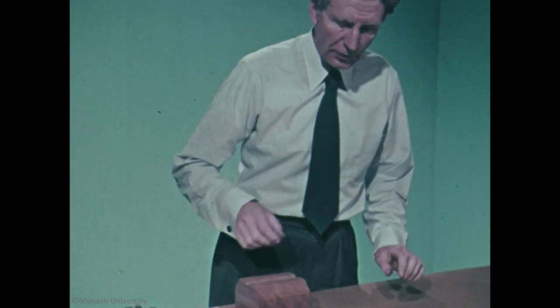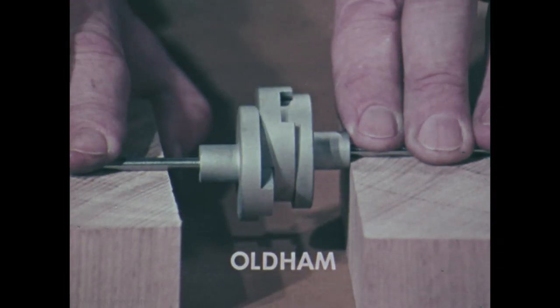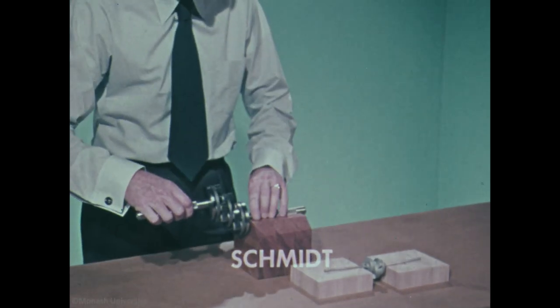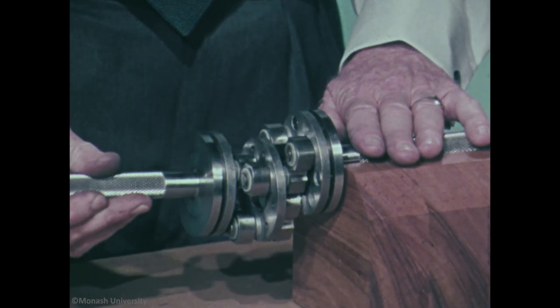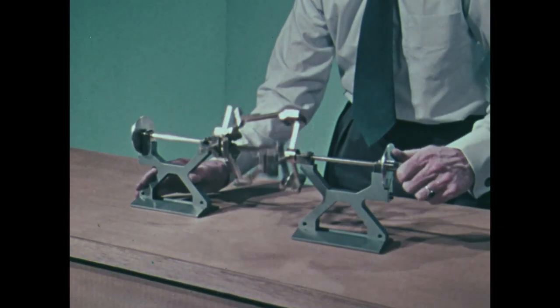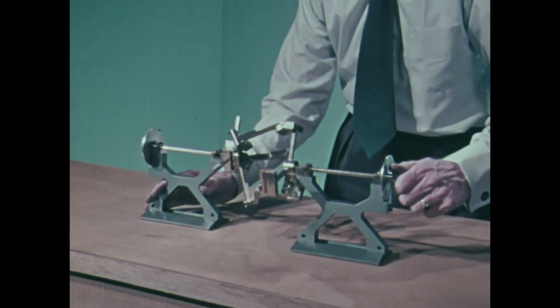At the present time, there are, I believe, only two commercially available parallel shaft couplings: the Oldham and the Schmidt. Both non-plunging. Naturally enough, both of these comply with the general theory. Now, however, the theory reveals dozens or even hundreds of promising plunging geometries, all entirely new.